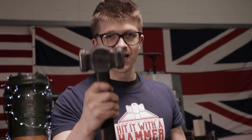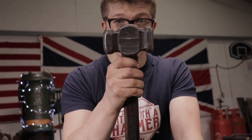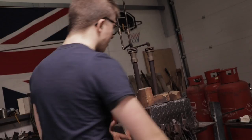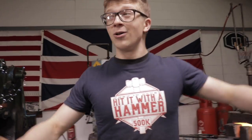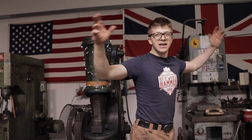Of course we need something to hit, and a hammer is very important for that. A hammer — you don't have to go too crazy with the complexities. This is a rounding hammer that I made, but a simple lump hammer from the hardware store that people use to drive masonry chisels is going to be completely adequate in the two and a half to three and a half pound range. You're going to be flying and able to do pretty much everything we're going to be doing here today. There are all sorts of more stuff you can have — tongs, machining equipment, power hammers — but the great thing about blacksmithing is you can really start from very little and slowly build your way up in terms of tooling.